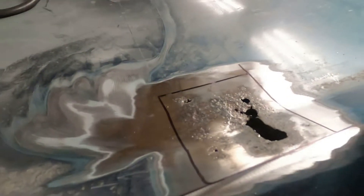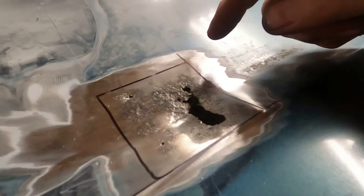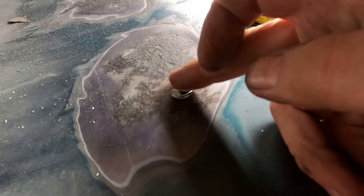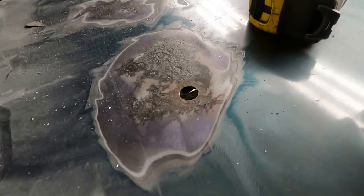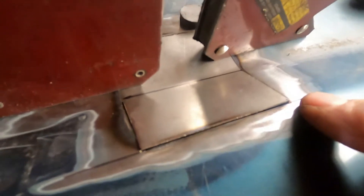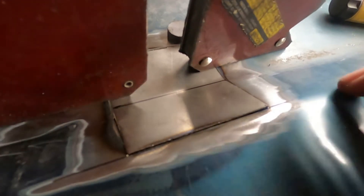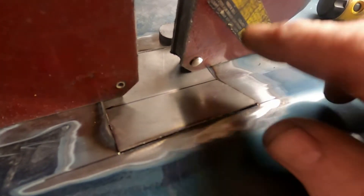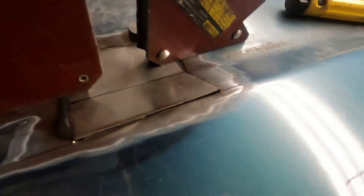Yeah, they drive around their country I guess, but anyway it's thin as heck and it's a little tough to weld, so be aware of that. Now here's the other side — the passenger side. I've got it all lined out, I'm going to cut it out, and over here I've drilled out the bad spot and got into good solid metal. I'll come from underneath with a small plug, weld that up, and fill it in. Old piece is cut out, new piece is set in place — I'm going to tack this in with the welder.